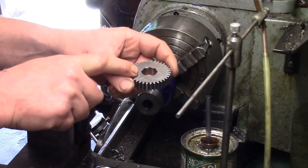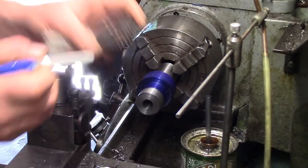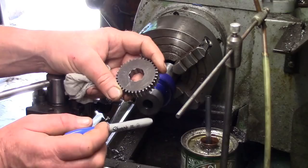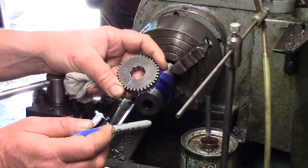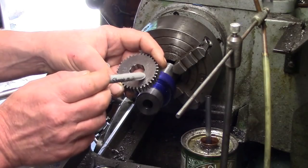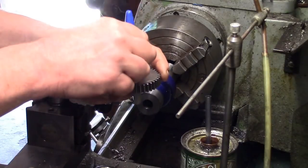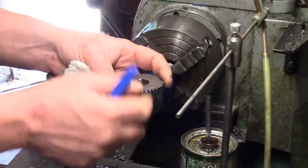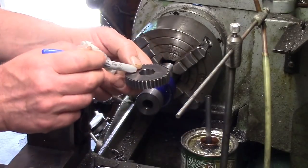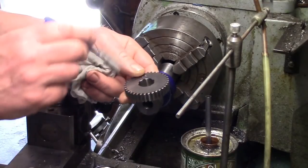He put that bushing in his dividing head and he cut one of the slots like this, and these have got, I can't remember how many they've got now, 1, 2, 3, 4, 5, 6, 7, there's 8. So on his dividing head he had it set up to cut 8 increments, 8 slots, 8 divisions. And on the second division he cut just a tiny little mark, and he had a locating pin on it. So you drop the bushing in here, you cut the first slot, and then you move the slot you've just cut onto the top of the pin, which was 1/8 of a division around there, and that located it and then pushed it through to do the second one, and vice versa all the way around.